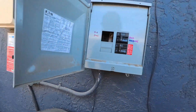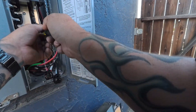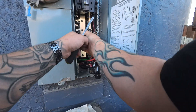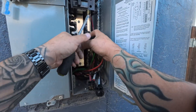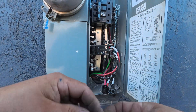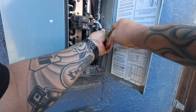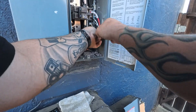If you watch my videos, you know how to get sharpie off — a little bit of dust wipes right off. Let's check this stuff here — this is the feed going to that little sub panel we were just working in. Just check all these connections. That looks good, just a little stucco in here. These things are missing a plug so let's get them taped up. I'm going to check all these connections because everything was so loose. Look at that — loose. I don't know if we're breeding people with weak wrists nowadays, but it's ridiculous.